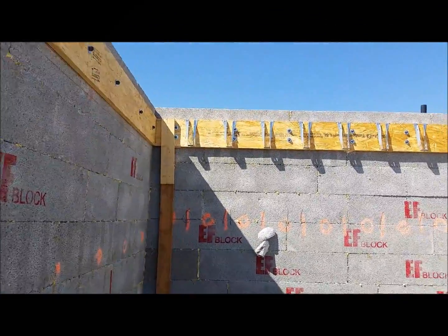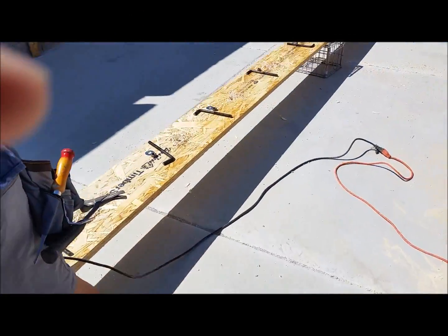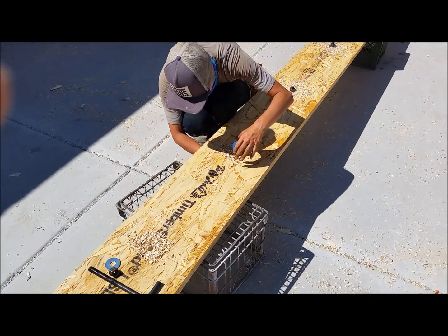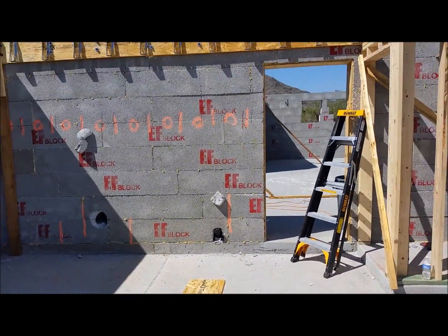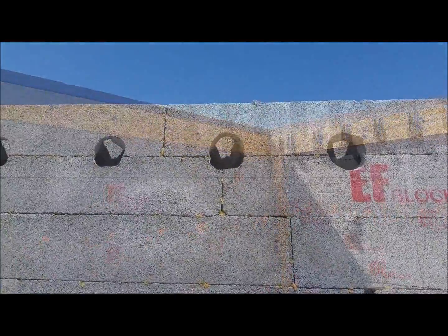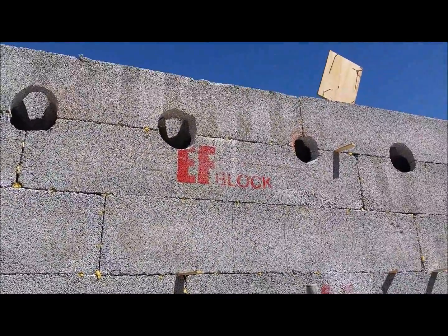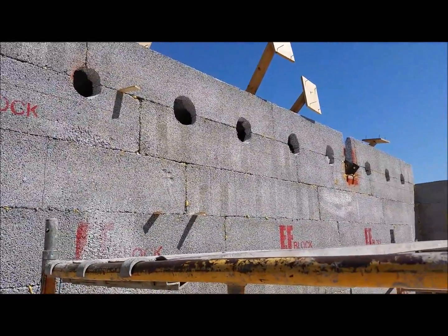We got all this up, the wire in pulling the bolts back — looking good. Now we're starting on the second ledger on the other side. After you get it drilled in, just put the bolts in with the nut and washer on it, then stab it in the wall like we did on the other one. By putting that ledger up this way, we avoid having to put plywood dams — the concrete grout needs to come to the surface so the anchor bolt isn't cantilevering in the block.